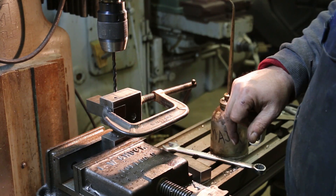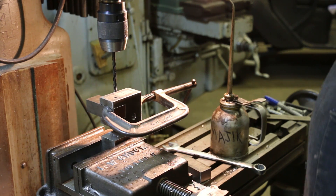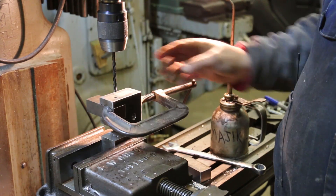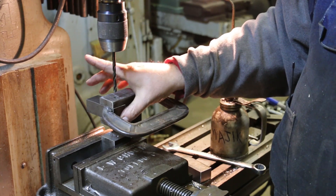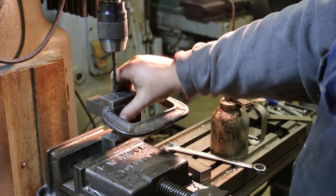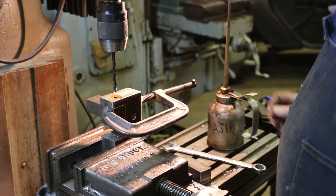With the pilot hole all the way through, I want to go ahead and drill the holes for my swing-down arms. The best way to do that is to drill them in place so we'll have them perfectly aligned. I've taken a C-clamp and got the top arm clamped in — the back is just flush. It doesn't have to be dead on, but it's pretty close, and that's good enough for what we're doing. We'll punch through this arm and then do the other one as well.